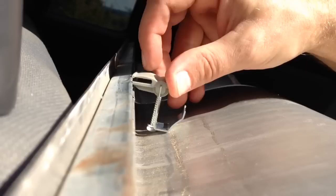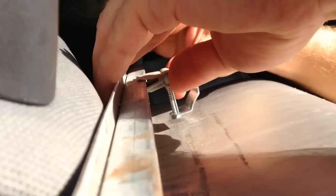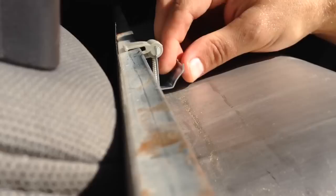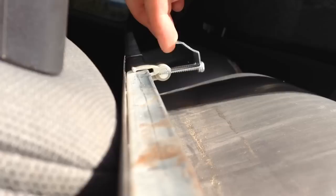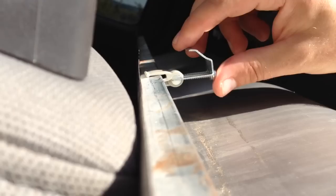And if you're going to install it on the sink, you just put the fat part in the middle of the channel, and then you kind of have to use some force and just push it in like that. Now what you're going to do is put your clips around the sink and then drop it into the hole you've cut. And once you drop it into the hole you cut, these will rotate back, and then this will be biting onto the bottom of the countertop. Then you screw this guy in and just try to make that straight — it won't go beyond straight — so you just kind of pull it all the way and then screw these guys in. That's how you would install it.